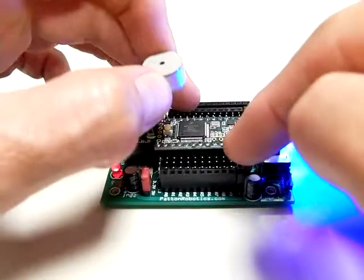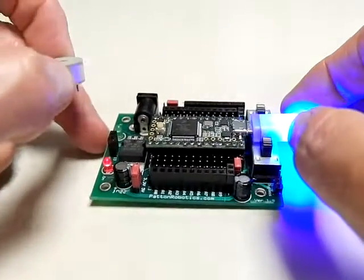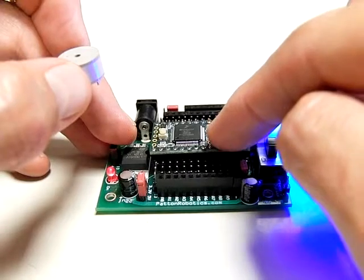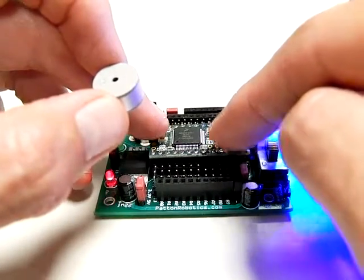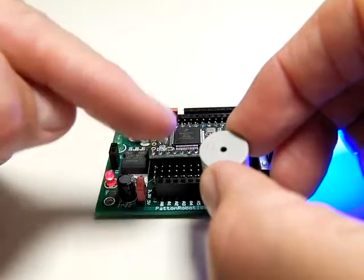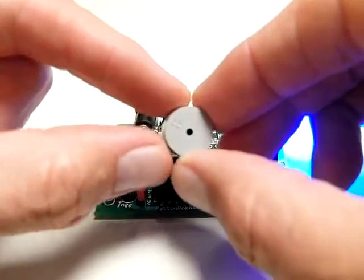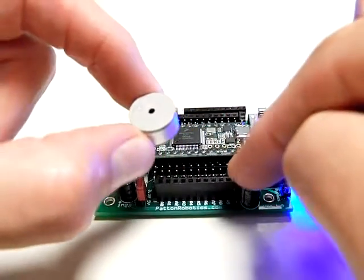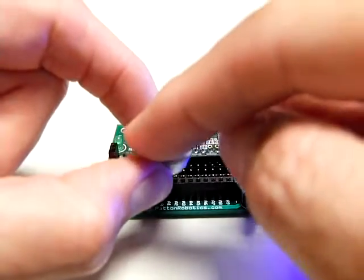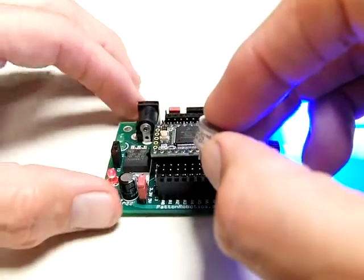What we're going to do is set the pin mode for A7 to be low throughout this entire sketch. So when the code loaded, pin A7 became low. Then pin A4 alternates between high and low. If the pin is driven high, power goes through the piezo positive lead and into the ground pin, A7. If you drive the pin low, both the positive lead and the negative lead will be low and there will be no sound coming out of the piezo buzzer.